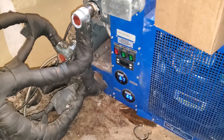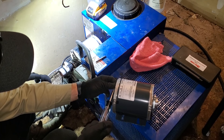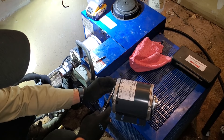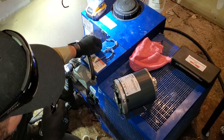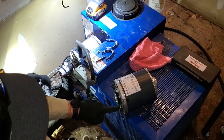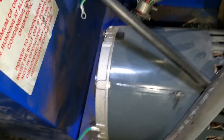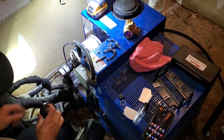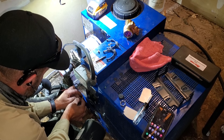We're going to start with changing that pump and then fire these guys up to see if they come down to 10 degrees. I'm going to try to leave the cradle on the existing unit and just swap the motor over so we don't have to unbolt the cradle. It's imperative that you get the ground wire on because this is a resilient mount — the motor has no ground without this wire because it's sitting on a rubber mount. The existing one doesn't have the ground wire on it, and only has one strap holding it — the strap on the back is missing and the ground wire is flowing freely.